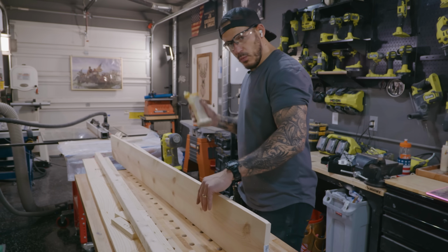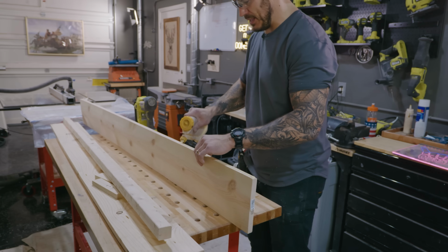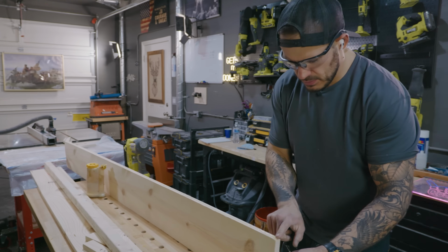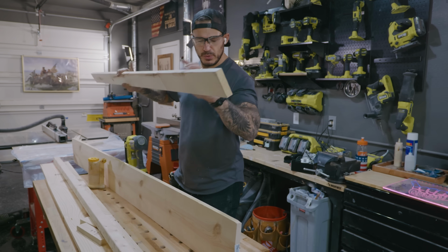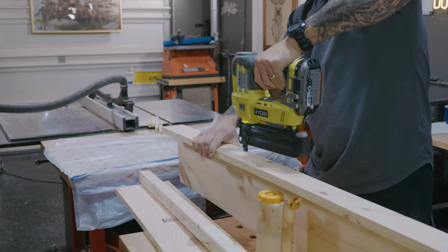So first up, wood glue. I use Titebond 2. It has a tensile strength of like 3,500 PSI. It's crazy. Nice, good sliver on there. Use the finger as your little brush to spread it all out and make sure everything gets contact. Use your 72 inch by 3 inches for your front. Line it up and then use brad nails to put it in place.